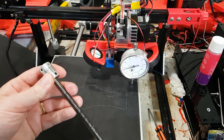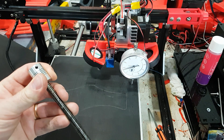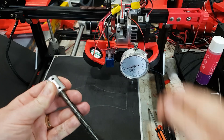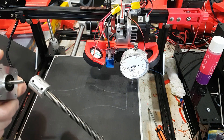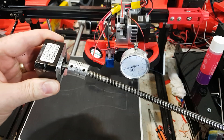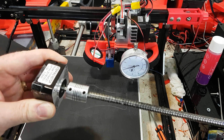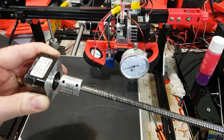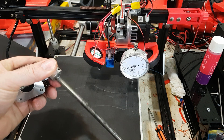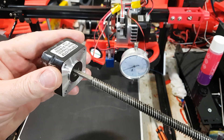The other option is to do pretty much the opposite — put the coupler right near the top and push the rod all the way through so the ends are touching, which allows it to flex. Except when you actually try this with your hand, you'll notice there's a flat spot as it goes around. The bottom of the screw is flat, so it wants to sit flat to flat.